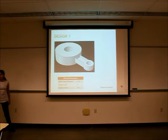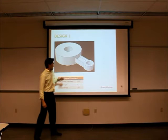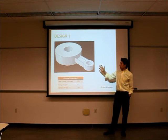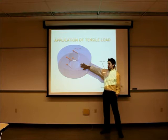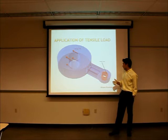This is the final design we ended up with. The flange thickness is a tenth of an inch all the way through. The height is one inch and one and a half inches across. For applying the loads, we used concentrated loads, making the assumption that the large hub would not fail. We applied four loads of 1,750 pounds each to produce the required 7,000-pound load and fixed the inside hub. For the moment load case, we switched the directions and the magnitude was 300 pounds each.